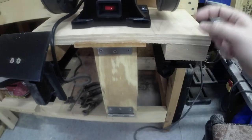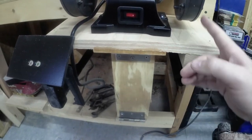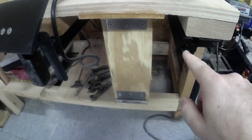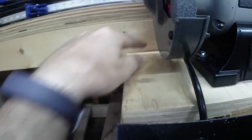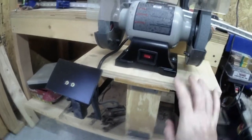The thing I learned when trying to sharpen for the first time: read the directions. It says the jigs have to be a minimum of six inches from the center of the wheel, and I mounted them too far down. What I need to do is take them off and mount them straight to the uprights on both sides — and because of the length of the bar, I'll have to cut a notch in the back so the bar can go through.